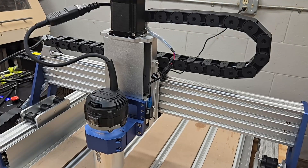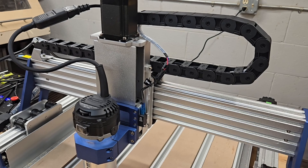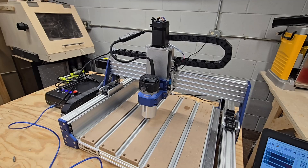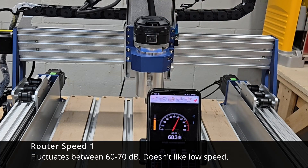I'm testing the Z-axis by jogging it up and down. I noticed I don't have enough slack in my Z-limit switch — if I go all the way down it's going to pull out my cables, so I had to open up the drag chain and get a little more slack for the Z-axis limit switch. The Z-axis looks good. Now it's time to jog the X and Y and make sure nothing gets bound up. Everything looks good — now time to test out the router.